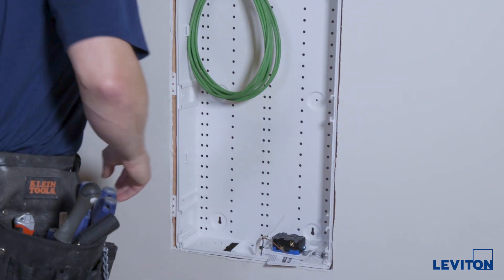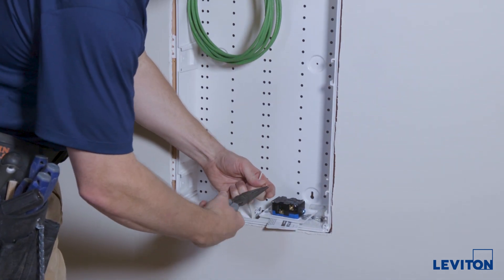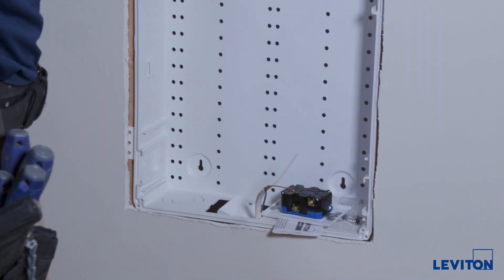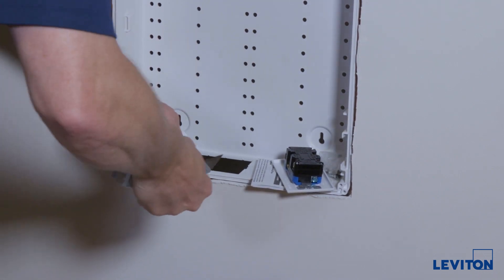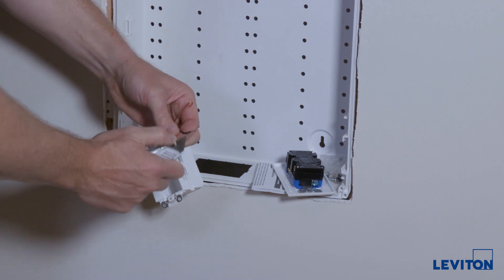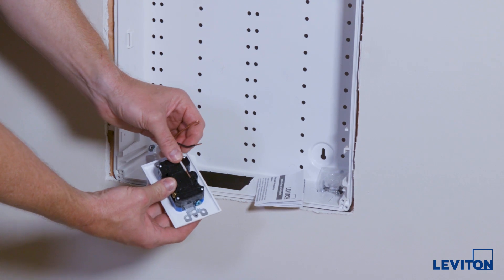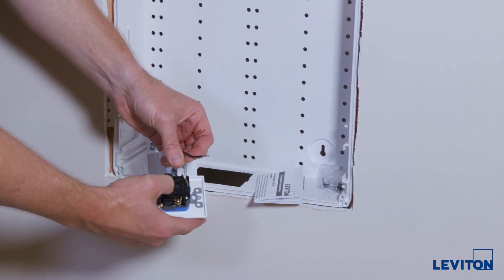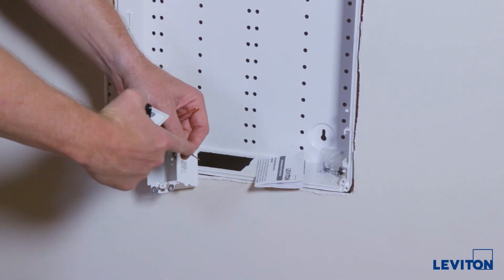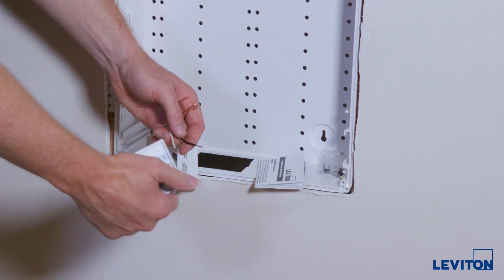To do the ground, we'll put a small hook in the cable and go around the screw. We'll go ahead and strip the cable — strip out a half inch. There is a strip guide on the back which I'll use to check. After you strip this out, you can check to make sure it's long enough using the strip guide. It's important that these are not too long because they'll leave exposed copper, and if they're too short they may not make enough contact, which would be a problem.